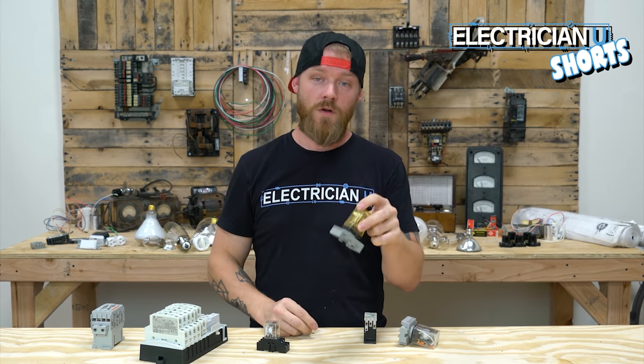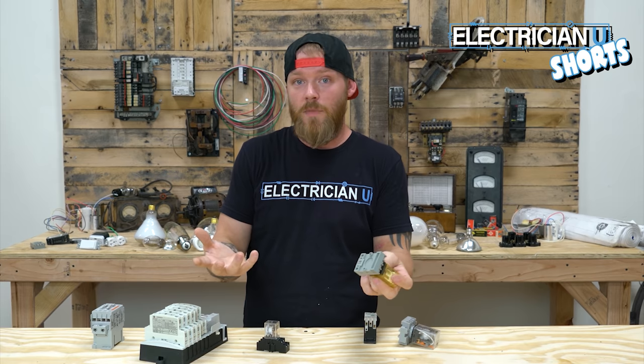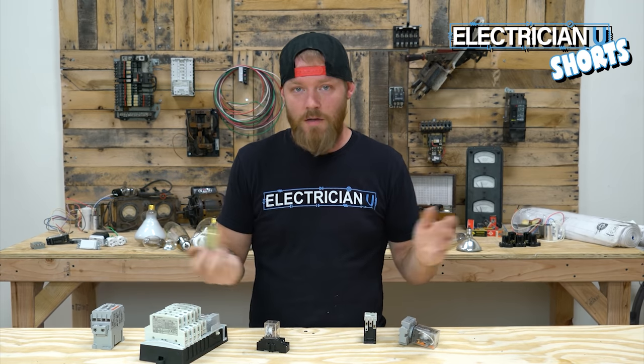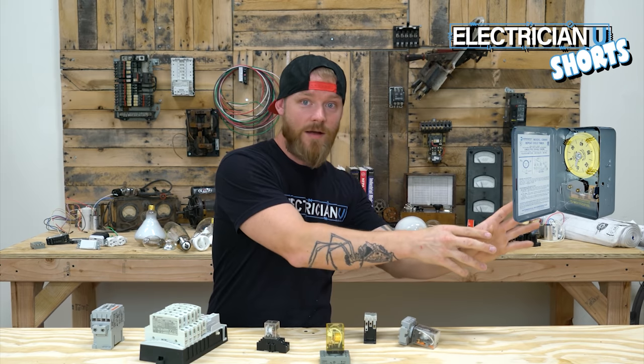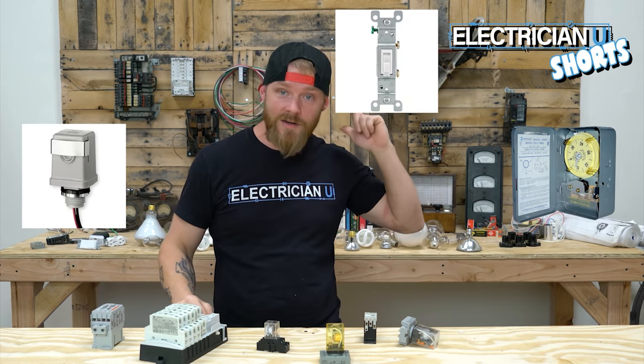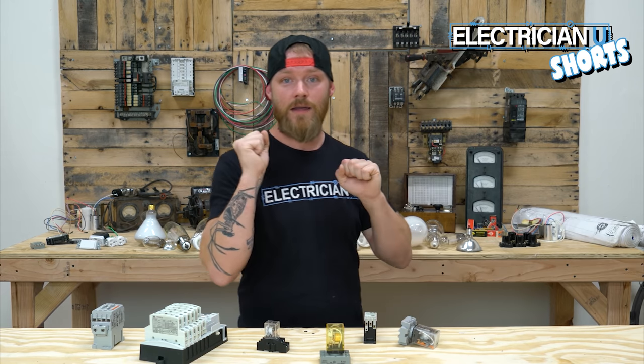You need to bump it with a 120 volt circuit, like a control circuit from somewhere else. Usually how that's done is you're going to have a time clock somewhere, or a photo cell — you could have a light switch — but there still needs to be some either manual or automatic means of sending power to that contactor during certain times and taking that power away. Thank you guys so much for your attention and I will see you in the next video.